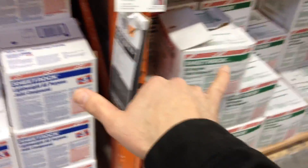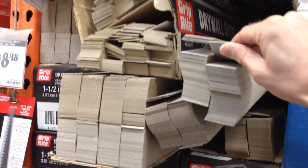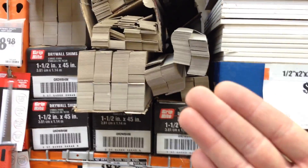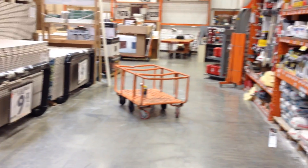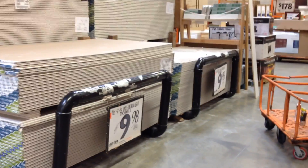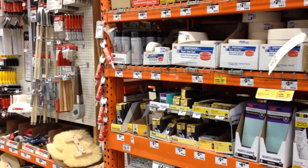Basically, you can get either one of these for your first coat and then get that light blue bucket — the topping compound — for the second coat. If you're putting up sheetrock and your walls are uneven, they sell cardboard strips you can shim and attach to the wall to fill in the voids if your framing job is uneven, but you could use anything for that. And as I said before, a Home Depot employee told me for $35 they'll bring it to your house — not a bad deal if you're finishing a basement. I hope this helped — please click like and leave a comment.